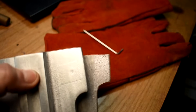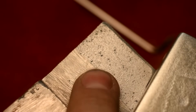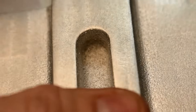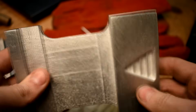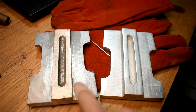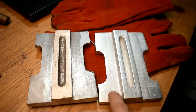We can compare the surface here — we end up with a beautifully reproduced surface finish. You can see a piece of scotch tape. On the old one, you have the craters of the moon. And even with that little bit of hot tearing, compared to the old groove, there's no comparison — the old one is just all disgusting. There is a sand grain here entrapped right on the end. That's what happens when you're not careful. To be fair, in most of these videos I'm rushing to get them out and I'm not as careful as I should be. But I think that was a pretty good casting. This is like five years of difference. The old one looks like garbage — I didn't know what I was doing. This one — I know what I'm doing a bit more. That's visual progress.